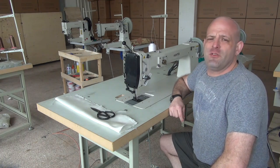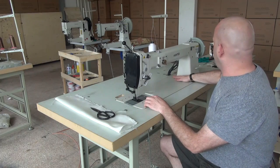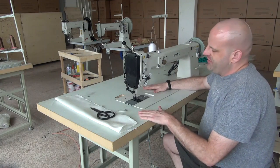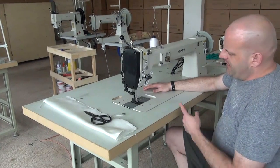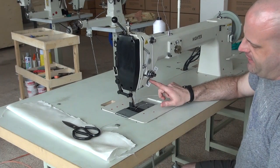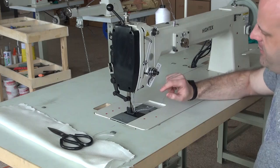The 72600L25 is a long arm machine — 25 inches to the right of the needle, so the usable space is 25 inches to the right of the needle. It features fully adjustable stitch lengths and a fully operational reverse mechanism. This particular machine is set up with a pneumatic presser foot lifter, so when I push down on the pedal you can see the presser foot lifter goes up or down. I can also activate it just by pushing this button.